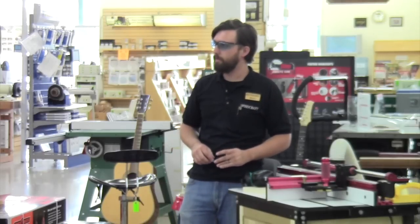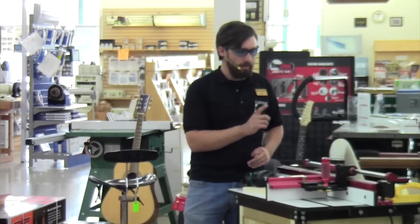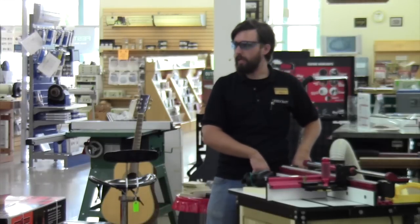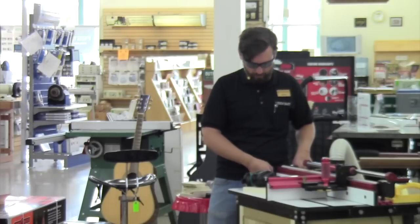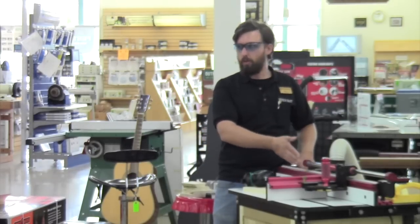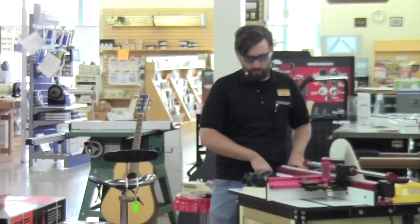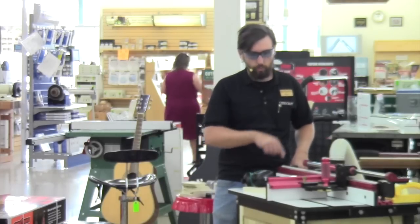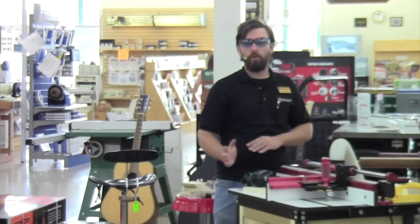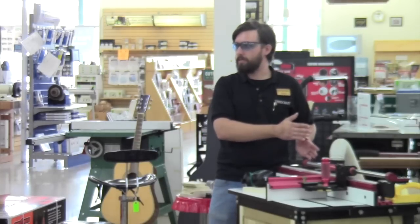If you use the regular miter gauge, you have to make sure that fence is parallel to the miter groove. This is a nice fence where you can set it to the gauge on the sides. I normally put this zero on center. I brought the fence up close to it — the gauges weren't actually set, so after I brought the fence up I zeroed out the fence to the rules on each side using the little thumb screw underneath. That way any adjustment I make I can do it from that zero mark and know that both sides are exactly the same.